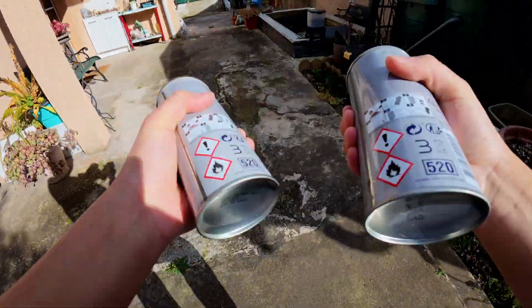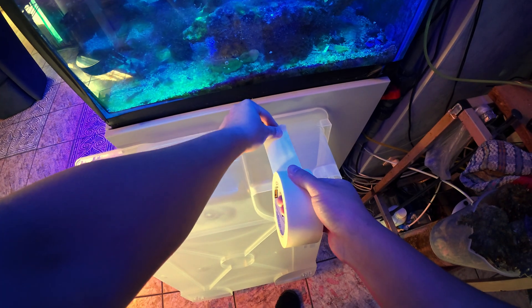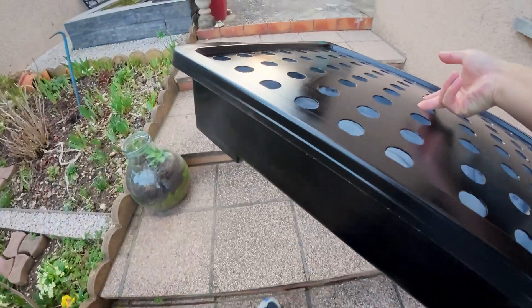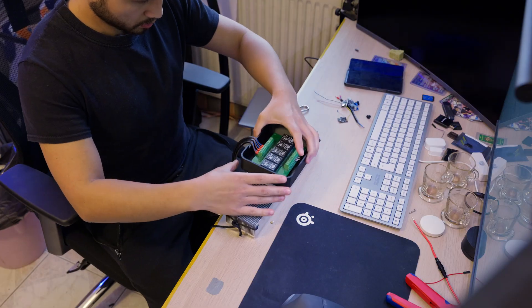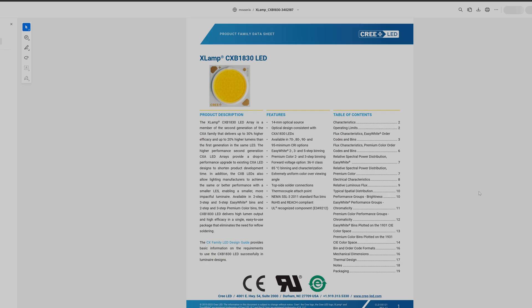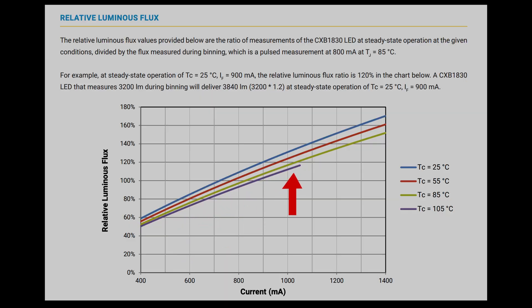Then I must black out the plastic — otherwise algae will grow from the light. I'm also proud of this neat idea to check the water level: apply some masking tape before painting, then peel it while it's fresh. Light is the second most important thing in this build, right after water quality. It must be bright and efficient, as it will be running up to 16 hours a day. I found these high-power efficient LEDs — affordable, but they need a specific circuit to limit the current, as the brightness depends on it.